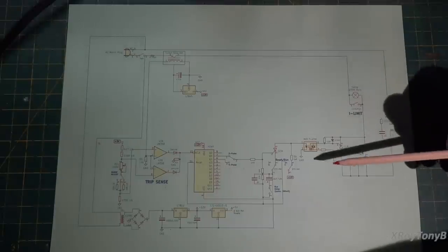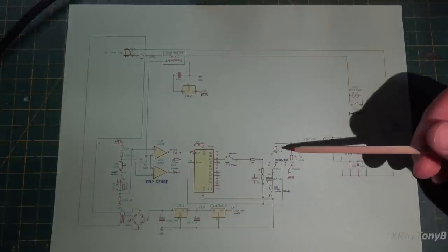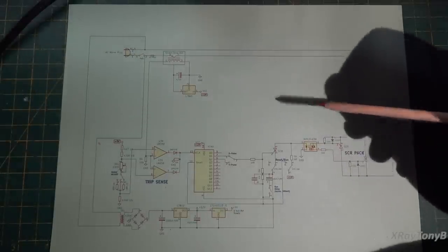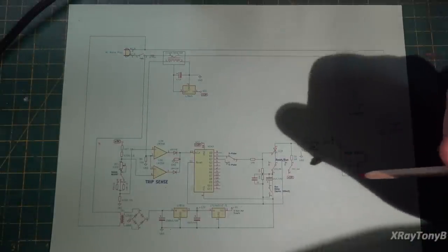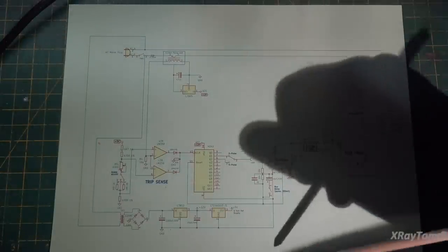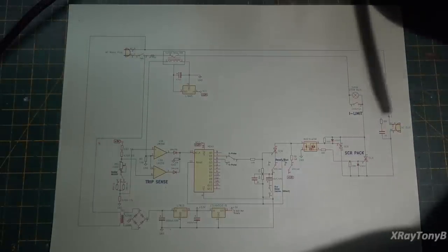You'll notice this is a very different circuit from what the last video had, and there are several reasons for that. Reason number one is that triacs have come a long way over the years, but you still have to have a pretty big triac to handle the heavy load of a short. A lot of components can deal with shorts for very short periods, but if you get more than a couple of cycles, you're going to burn up even the bigger size triacs — as has been seen on some of the Carver gear we've serviced on this channel.